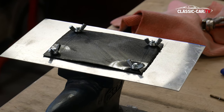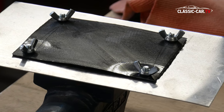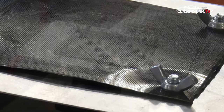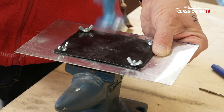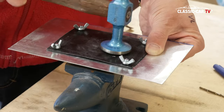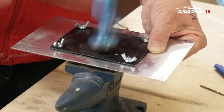It is best to place this package on a suitable anvil. It may be that the form still bends outwards, since the sheet between the two forms still prevents the holes from fitting exactly. In the next step, the surface of the mould is tapped with a smoothing hammer. The flat smoothing hammer spreads the driving impact over a large area.